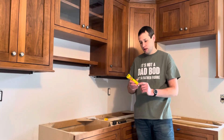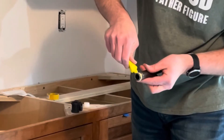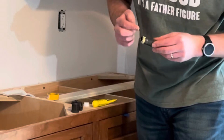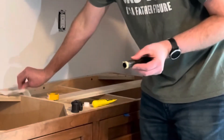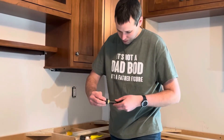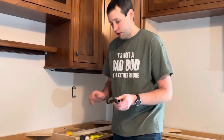First we'll show you is a liquid. You're going to apply it liberally — a thick coating onto the threads. You can use a brush or use your finger to spread it around. When you do this you want to make sure you're not blocking the inlet of the pipe with the sealant. And then you can screw your fitting on and tighten that with a wrench once in location.